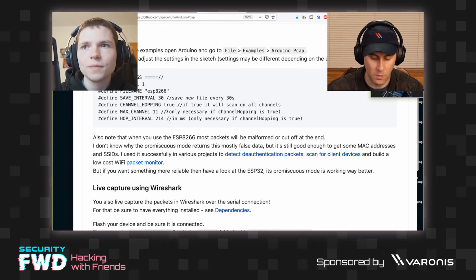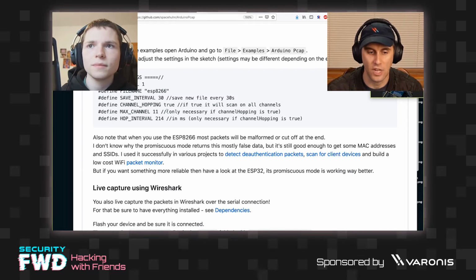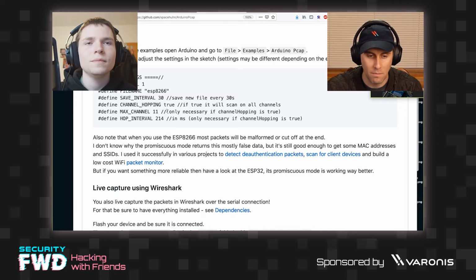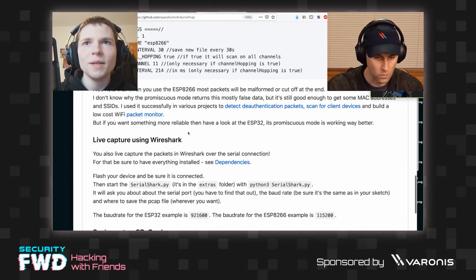Yeah, so as wireless people know, anytime you're scanning on a different channel, like if you're doing channel hopping, it means you're not scanning on the channel where some action might be happening. So if you have channel hopping set to true, odds are you're going to be missing a bunch of packets from maybe the device you're interested in, because the radio is going to be on a different channel most of the time. So it's only going to pick up packets that are there when it happens to be listening. So if we do happen to know, maybe after the first scan, what channel our target is on, it's really worth our while to disable channel hopping and just zero in on the channel where our target is operating. Otherwise, we have just too many packets and we'll probably lose what we are looking for.